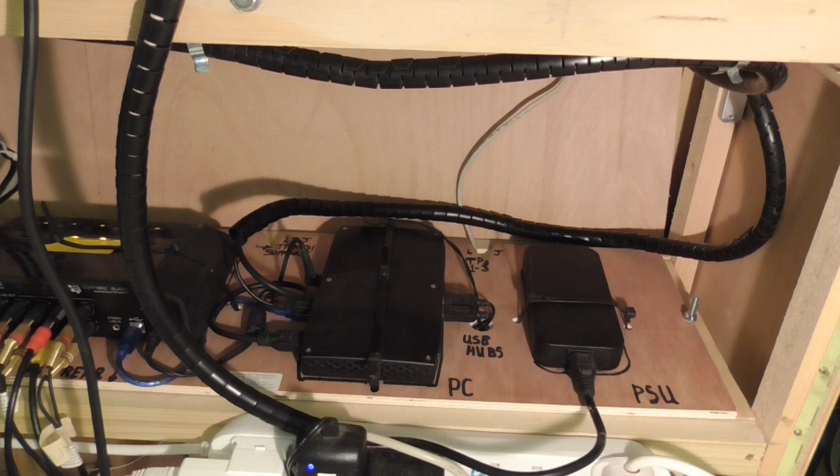The idea being that there is a backup readily available, because SSDs, solid state disks, do have a technical issue in the kind of gates that they use. The way it's built in NAND technology, it has a limited number of writes for each memory cell, each bit. Now, fortunately, in Hauptwerk, it's a fairly static situation. Once you've installed your sample sets and you've cached them, the machine stays pretty well as it is. So it shouldn't be a problem with a Hauptwerk application.